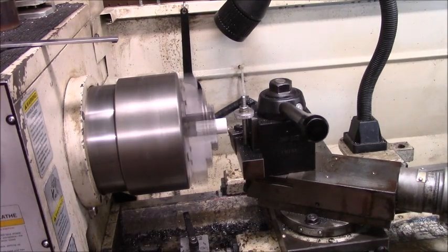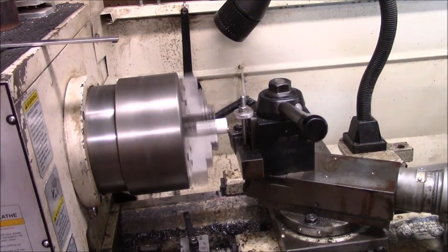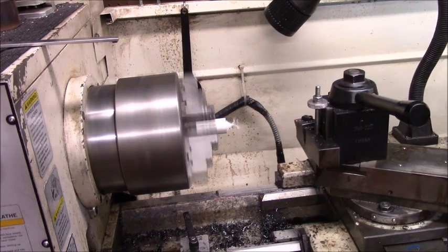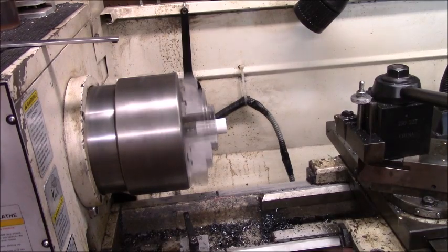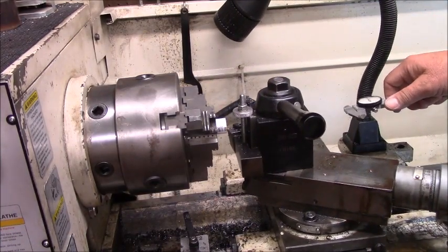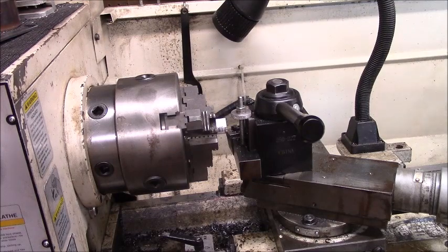All I want to do right here is just make a quick little pass with the Grizzly. Make sure this is true. Now let's take it to the lathe and chamfer it. So now we've got a little chamfer. I measured this a while ago and we wanted about 740 to the OD. This is a case where we're cutting it straight off the pipe. Depending on the cup that you use, you may have to glue the fitting onto it depending on the opening. So you've got to check your cup.